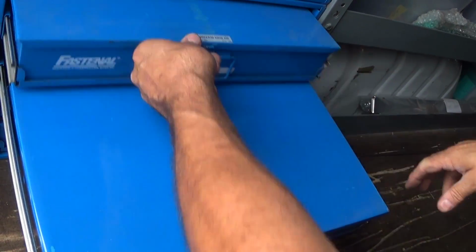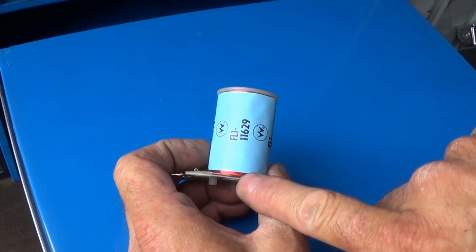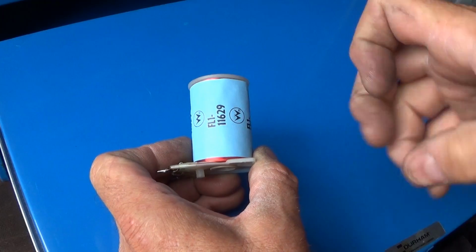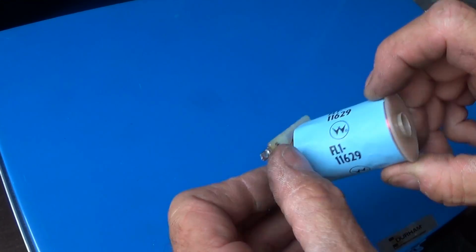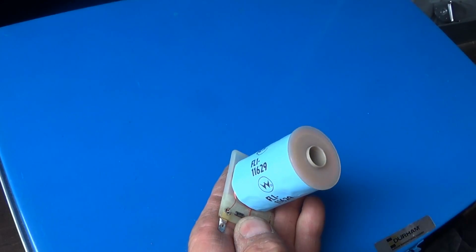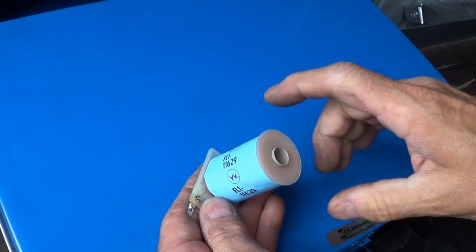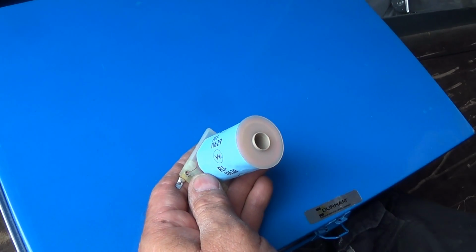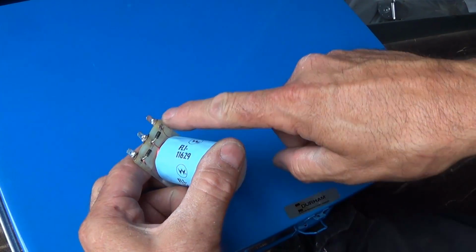Coils get exercised as they get used, and the varnish windings you see here shrink and contract, shrink and expand, and then that rubs off the varnish, the shellac. And contrary to belief, these are not bare wires, and they have a coating on them. As these things get used, they expand and contract, and then it rubs its own coil. I mean, shorts. Yes, and then the ohms, which are readings across the coils here.